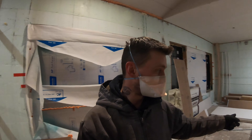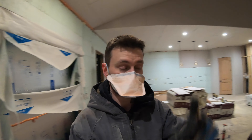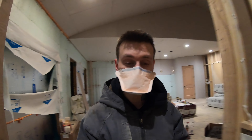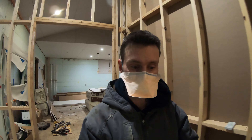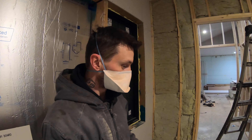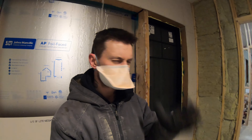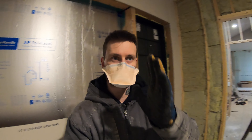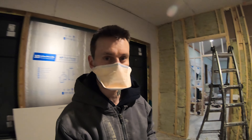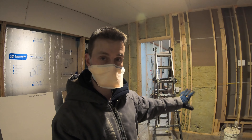So it's kind of like, screw it, keep it. Now this stuff over here is meant for a two by ten — so nine and a half inches of cavity — and that will give you an R30 value. Our bedroom wall over here that we're insulating for soundproofing, not for insulation, is only a two by six wall. So we're basically kind of ripping them apart, which is super easy. It's not going to be a full five and a half inches — it'll be a little wavy, but not that much of a deal, especially if we're going to double drywall this side and put up acoustic sealant and all that.